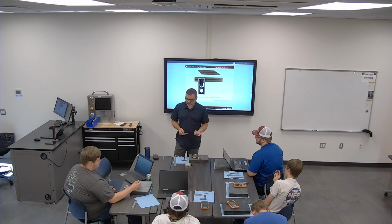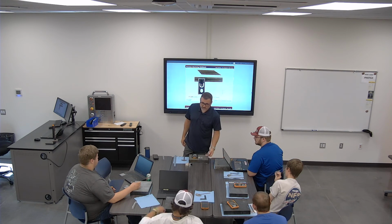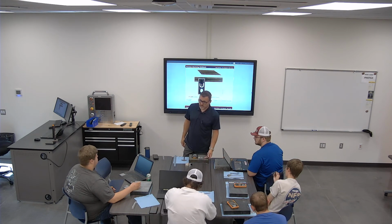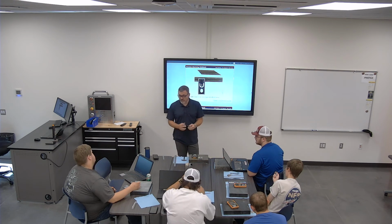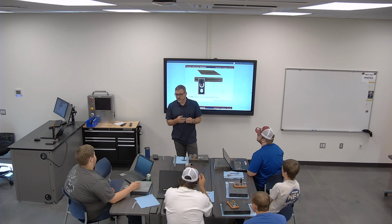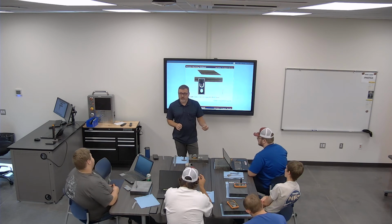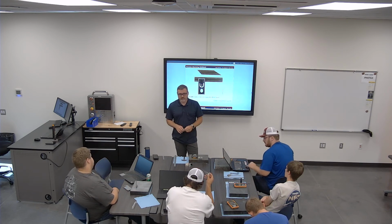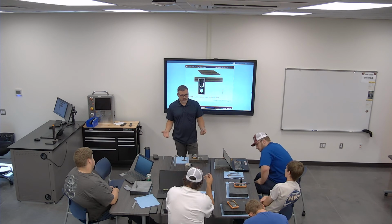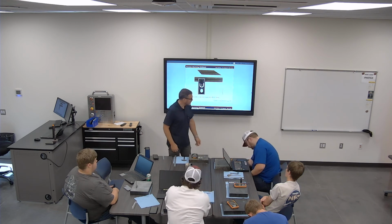One of the ways you might check that is I would not check it by bringing it up against this, because this isn't necessarily guaranteed square. This is guaranteed flat. So you would bring it up to another square, or to a gauge block or a precision ground block that you know is square. Square your square. Lots of times you don't think about calibrating your calibrating tools. You want to find something that's typically 10 times more accurate to do it. So we have some things that you can use for that.